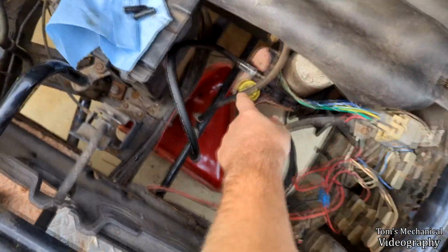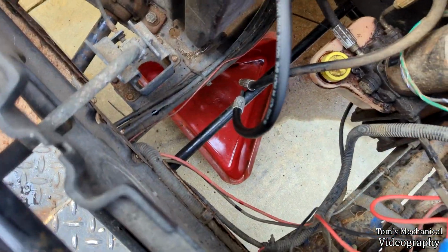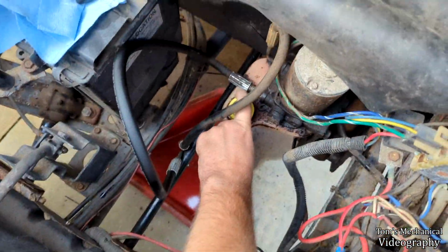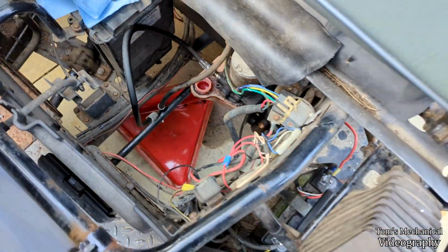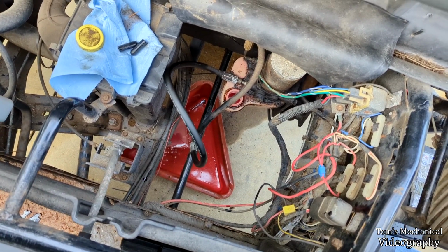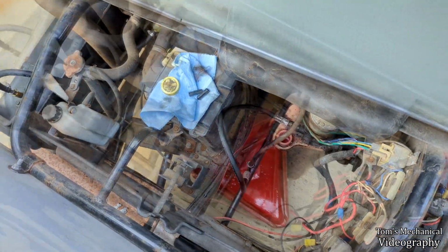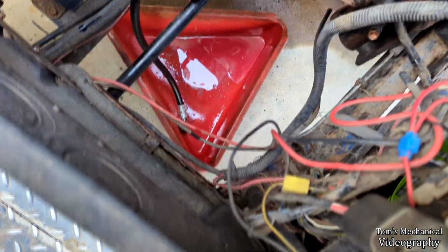All right, so I've taken the caps off, turned the key on, and this is the up line, because that connected there pushes the piston up. That's the down line. We're gonna run this thing up. I have no idea what kind of PSI this is gonna come out at. I should probably take this off too, so I can monitor the flow rate. And let's just hope it all stays in the thing. Oh yeah, it's got a little bit of pressure. That looks pretty damn clean now. I'm gonna say that's good for this first round of flushing. Let's run it down. See what kind of mung comes out.